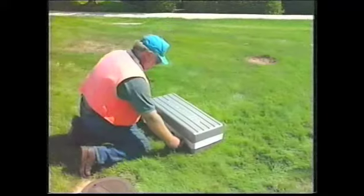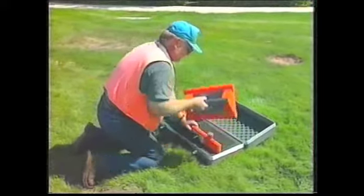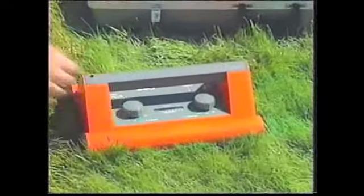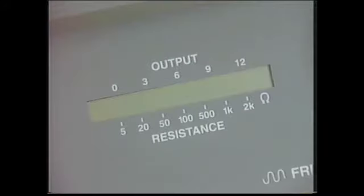When you're ready to locate, check the batteries on both the transmitter and receiver. On the transmitter, turn the power knob to the L or low power position. The LCD will display the battery status in percentage by the number of bars present. A slow beep every 5 seconds indicates the batteries are sufficiently charged. A low number of bars, followed by a fast beep, indicates the batteries are low.